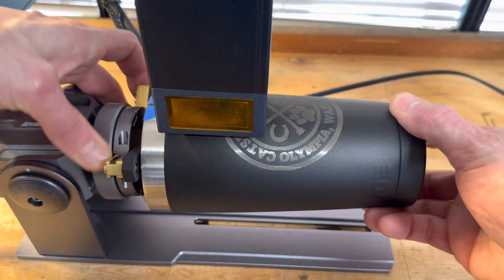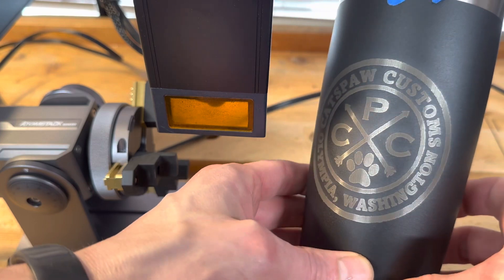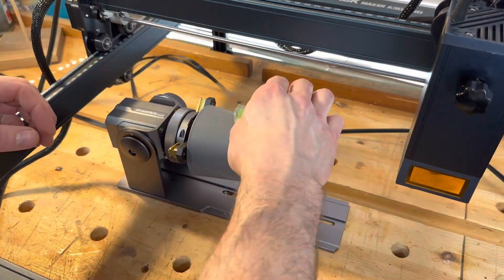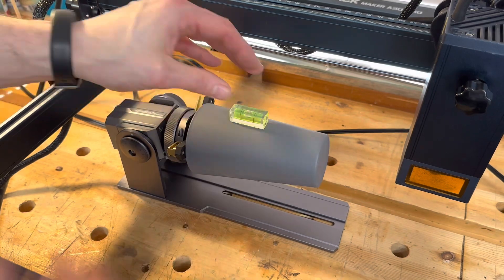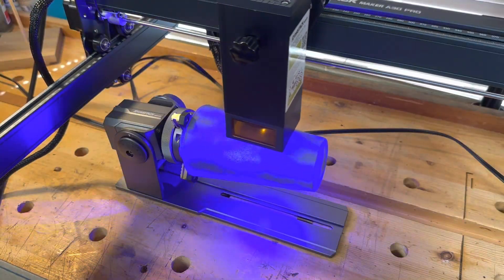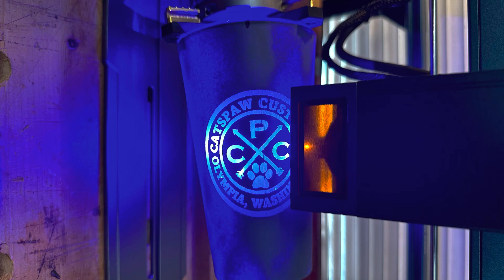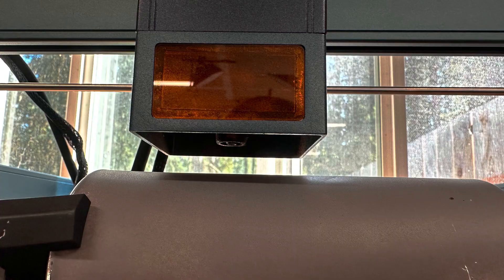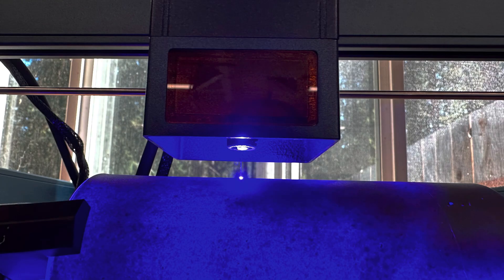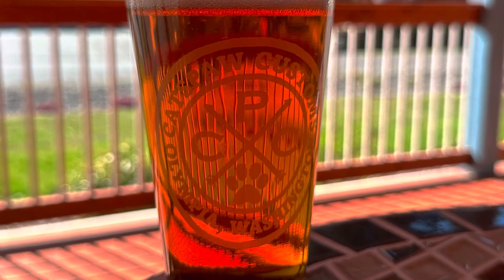Like the straighter mug I had done with the roller, this one came out really nice. I went on to try engraving a couple of 16 ounce pint glasses. I found there weren't a whole lot of great ways to configure the jaws on something as slippery as glass, and the glasses I had were also thick-walled and pretty heavy, so that didn't help. I found the best configuration was to hold the glass from the outside and raise the laser up just a little higher, which also diffuses the beam. I did waste a few glasses, but I ended up figuring it all out and got some nice engravings.